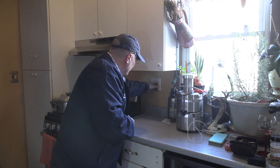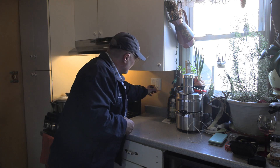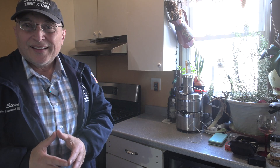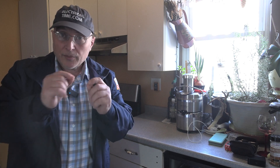So let's go plug this in and let's go see how it works. I got to reset this here — we just saw something. So I reset the GFCI receptacle device and I'm going to test it now. Let's pay real close attention. The lights turned off for the exhaust fan up here. Also, the display turned off for the gas stove. Also, we had a little motor — we have a little mini fridge — and you could hear the compressor turn off when that GFCI receptacle was tripped by using the GFCI button.